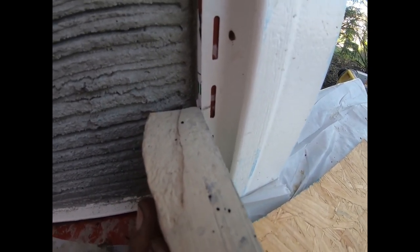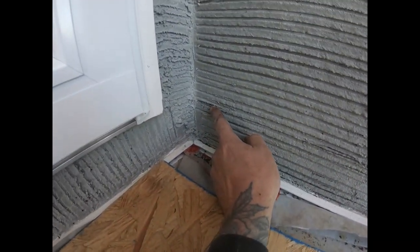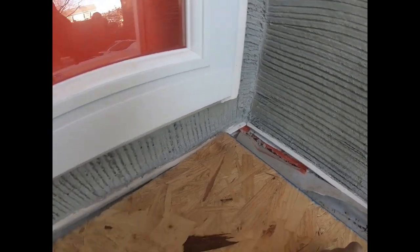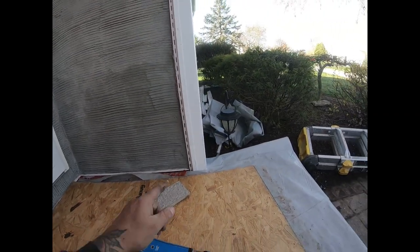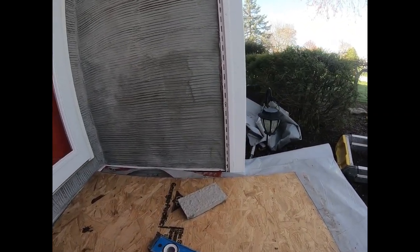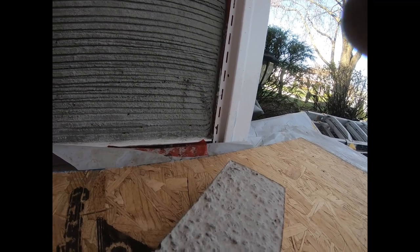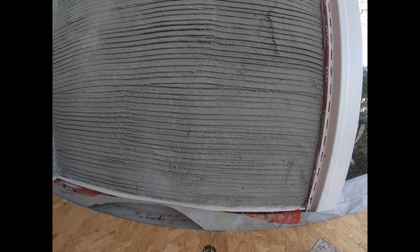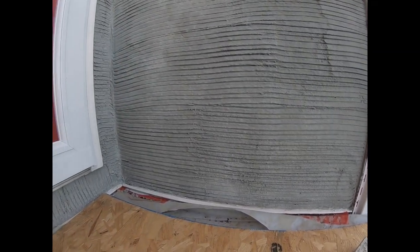You can see my little mark I made there — that's the lowest side of this wall. I always start at the lowest side, put my level on it, and carry that level mark all the way down the whole long run of the wall so my first layer is perfectly level. After I make those marks, I nail a board up so I can rest the stone right on it and start going up. At the end I remove the board and fill in the bottom.